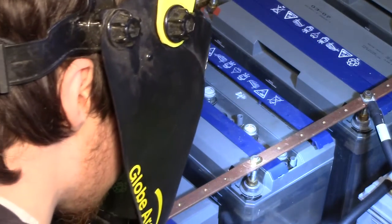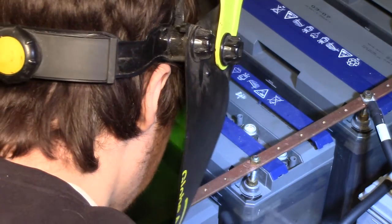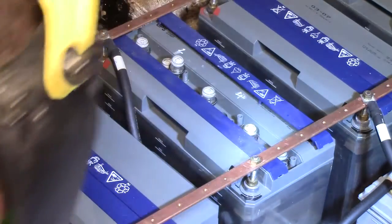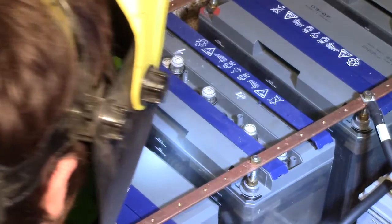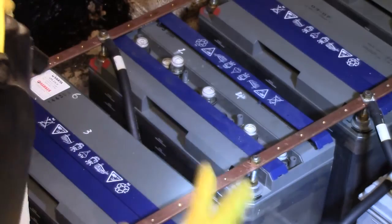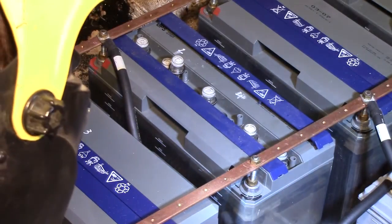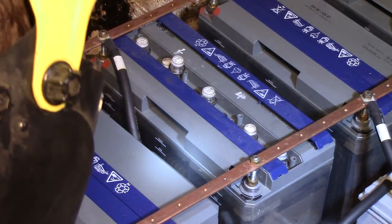And that is as much as I can deposit into that cell without overfilling it. So now that the immediate danger of exposed electrolyte has been resolved, I'm going to disconnect this battery and try to move it aside with the corks closed and give it a slight shake in order to try to jerk out the bubble of that cell.